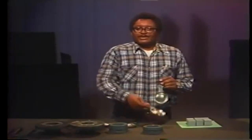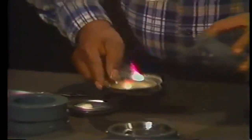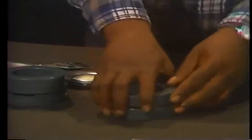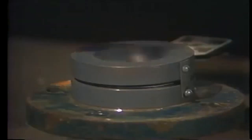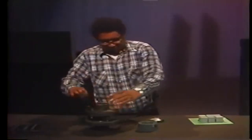We use a support device to keep the rupture disc bulging outward. The disc and support fit into a holder, which is bolted in place between two flanges. There are some discs that have a support device built onto them.